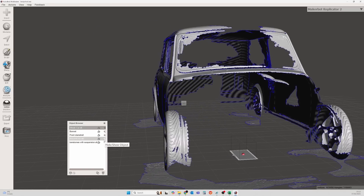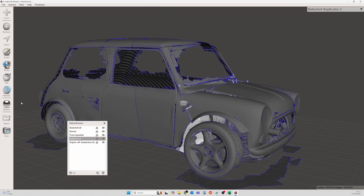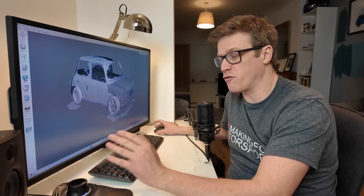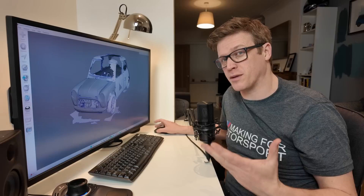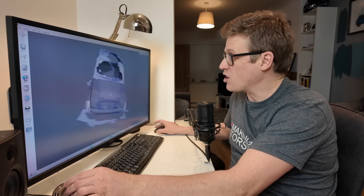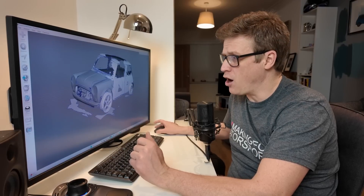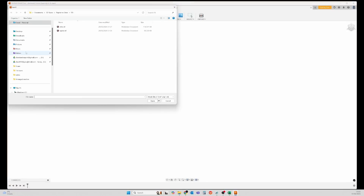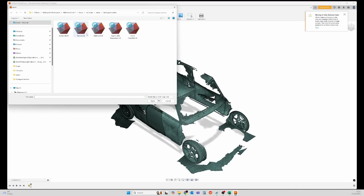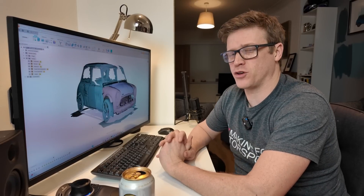So now we can take the bonnet off and the front off and we can start putting some detail into the model. I import the scan of the bulkhead and position that correctly against the body shell. Next job is to import the detail scan of the engine and suspension so we've got some detail under the bonnet. Once in position, I delete the overlapping sections of the mesh so the features of the car are only on one scan and not represented multiple times. Now we have everything in position, we can go ahead and export all of the meshes and they will all be referenced correctly to each other in the global coordinate system. I tend to use MeshMixer for a lot of this early manipulation of meshes because it handles large meshes fairly well — over 16 million mesh faces and 800 megabytes of mesh, and it's handling it very well.